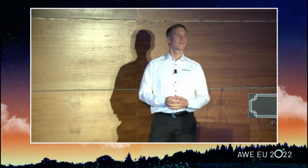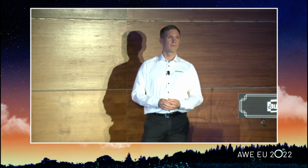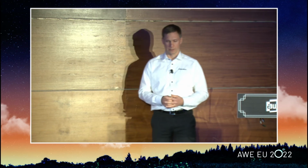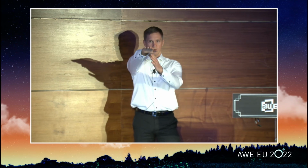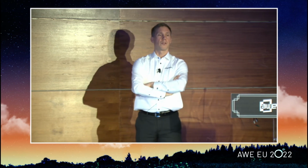Jussi, thanks for the great talk. Two questions actually. You introduced this 8-degree tilt. Is this a special design, so you always have to mount the waveguide at 8 degrees? No, it is not specific, but you have to think about it from the end device point of view, because this gives you some restriction. What is your input angle from the projector? What is the optical angle there? And what is the desired direction of the image? Is it coming from horizontal level, a little bit below, a little bit up? So you have to think about this from the end device point of view.